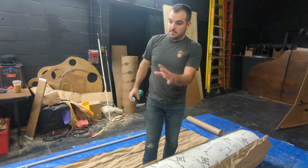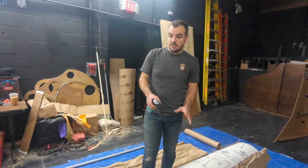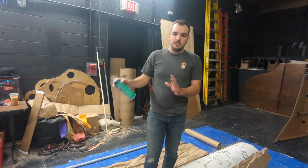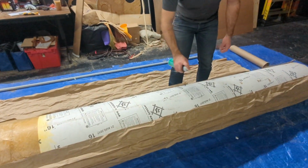So when you're working with glue in big surface areas like this, the first thing I put glue on is normally something that I either want to head start the glue drying, or that's going to retard the glue's drying a little bit to give me time to get the other thing glued, and then be thinking like that. Don't miss an opportunity to be wise, I guess.